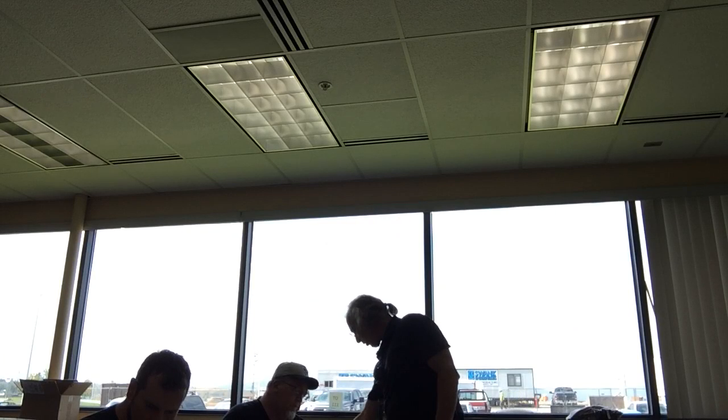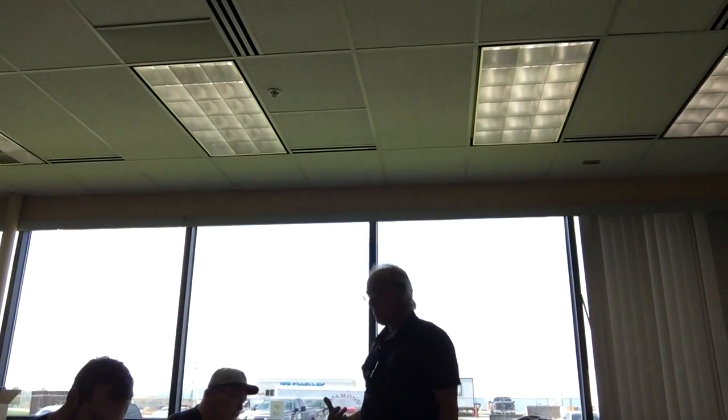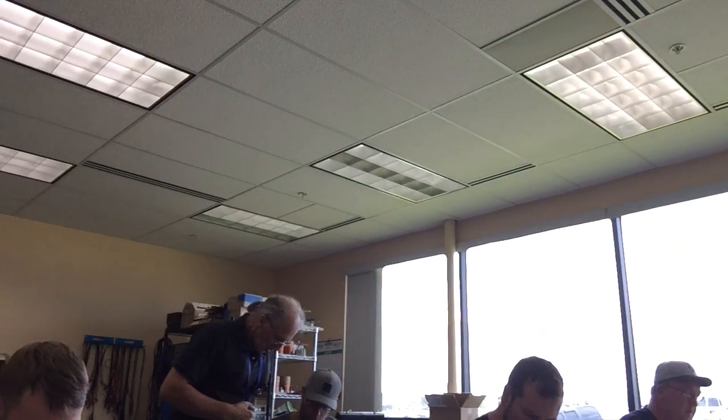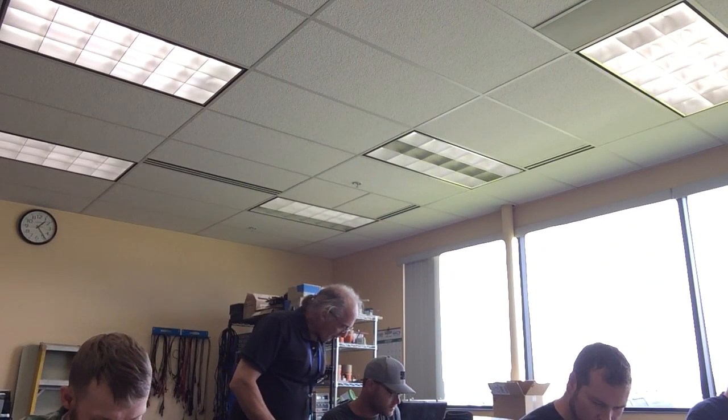Right. Show me an equivalent circuit. Okay, so yeah, this R total equals R1 plus R2 plus R3. Okay, and then show me that equivalent, and then calculate your current. Yes, sir. So this shouldn't go more than 198. 199. Okay. So I mean, you're really close.